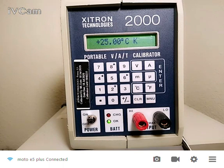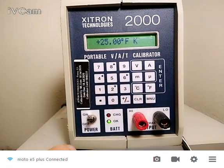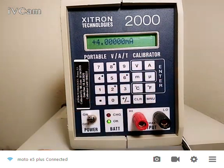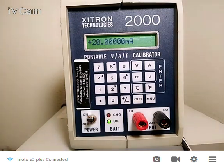The DC accuracy on this is 10 parts per million, which is about 10 times better than other calibrators in this price range. So it's a very, very precise instrument. If I want Fahrenheit, I can say 25 F. If I'm calibrating four to 20 milliamp current loops, I can just say four milliamps and then it outputs in current. I can put 20 milliamps.